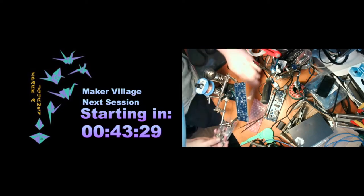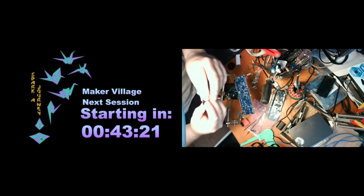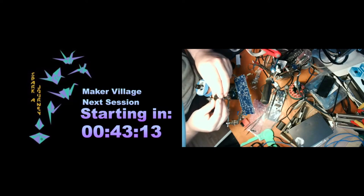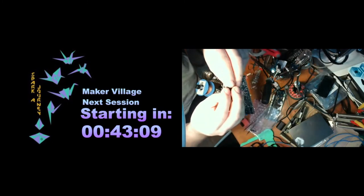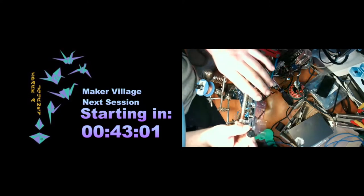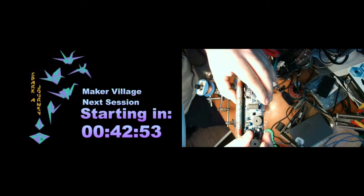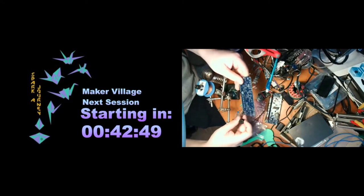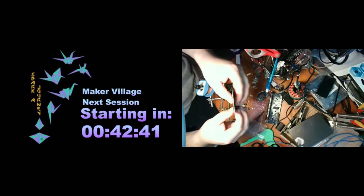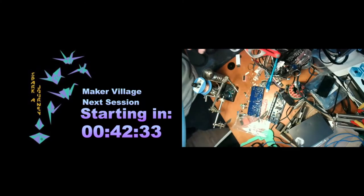Well, let's dump out these components. So we'll start with the buzzer. It's the easiest one. So let's see which one of these is positive. So this little buzzer. See how my previous one looks, because it doesn't really tell you which pins are which. Okay. Looks like the label has to be facing that way on the top of the buzzer. So I'm going to remove this. Going to get those lined up. Solder on there.